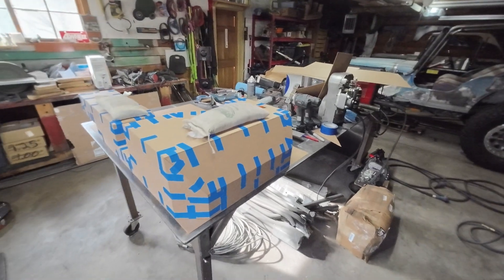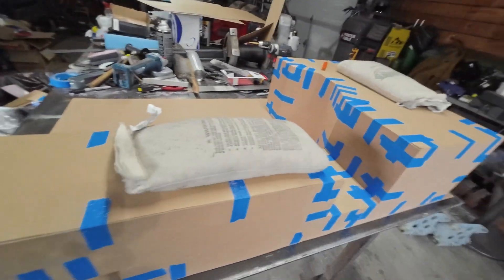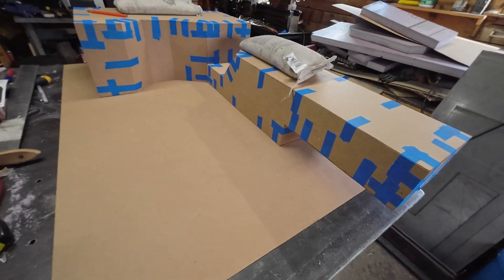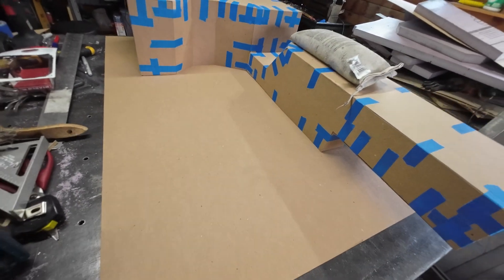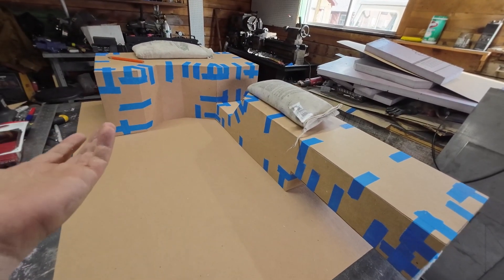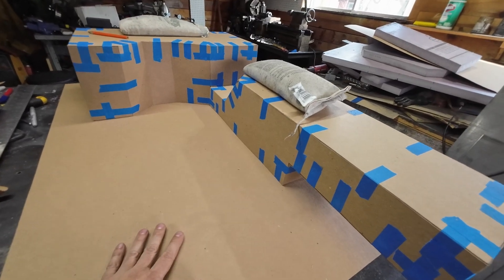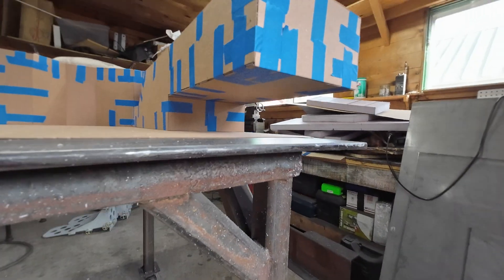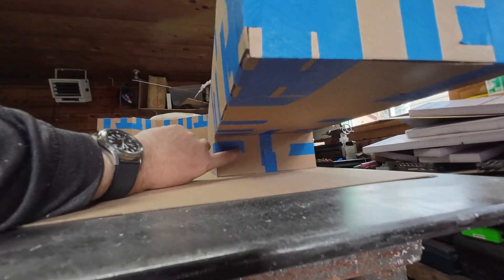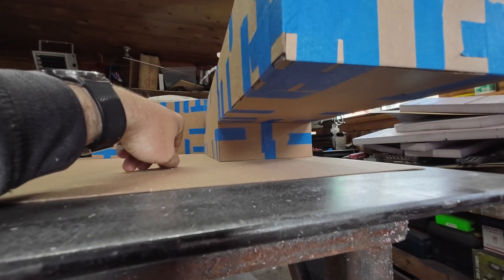I got the template all done today. It is completely done on the bottom of the tank, and the last thing I have to do is make the top panel — that's what this single sheet will be. I did the whole tank inverted, and once it was done I flipped it over again. The top panel is next, and stuff like this side underneath has already been done. If the bend order is right, this piece and this piece will be joined to the top just to get all the weld seams lined up and logical.